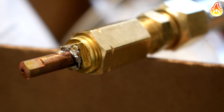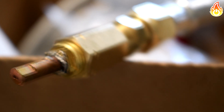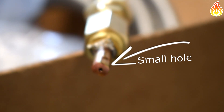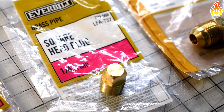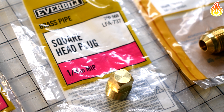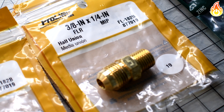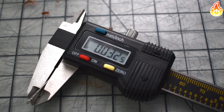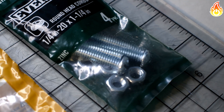Let's start off making the nozzle. This is where the propane will be exiting at a high velocity. We want to create a small hole at the end of the tube so that the propane exits at high velocity. I went to my local hardware store and bought a brass coupling, a square head plug, and a 3/8 inch flare to 1/4 inch fitting. The idea is to take this square head plug and drill a small hole in it. I chose a drill bit the size of 0.03 inches — one of the smallest I had — which should be small enough for the propane to exit at high velocity.